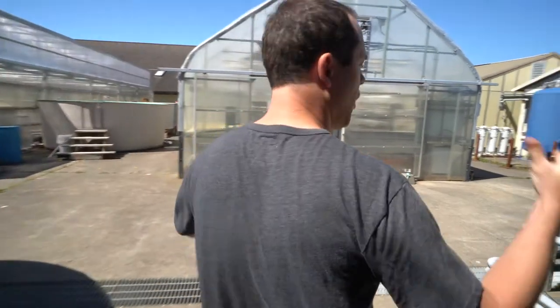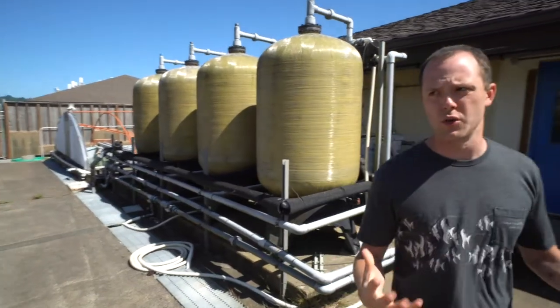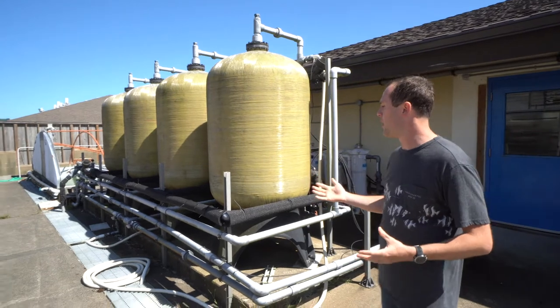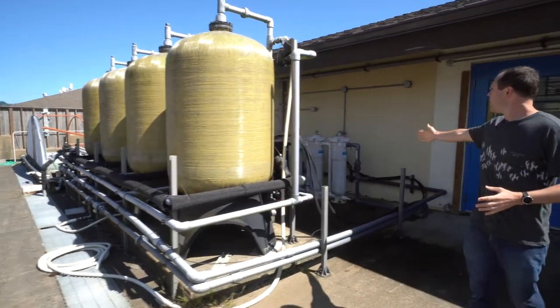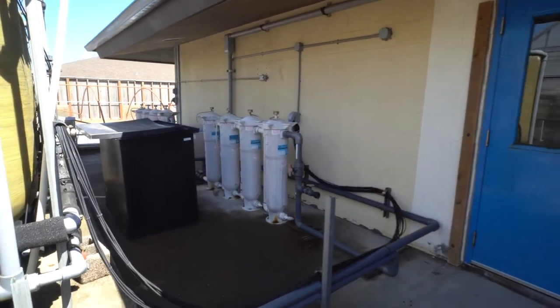Hatfield has a large pump house where they do all of their seawater filtration, but we take it one step further because we need really clean seawater and use a huge amount. Behind me are our sand filters that bring all of our water down an extra layer of filtration, and then after that we have our bag filters which get it down to that 10-micron fine level of filtration.